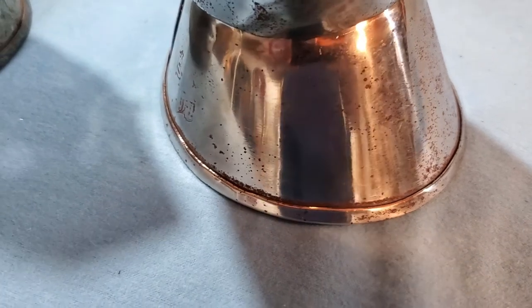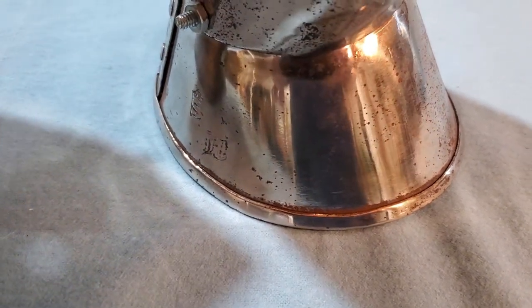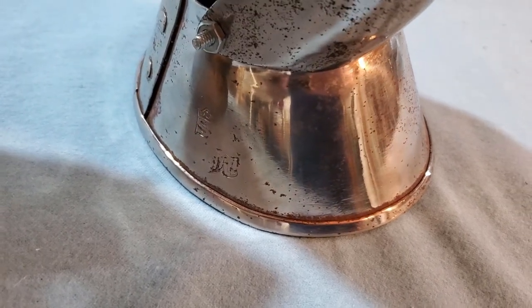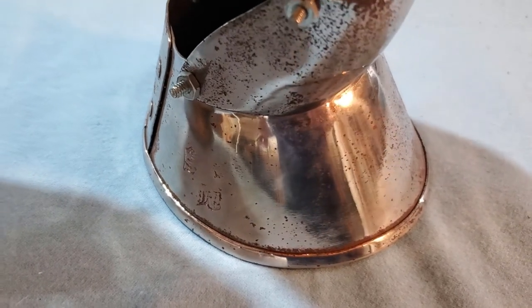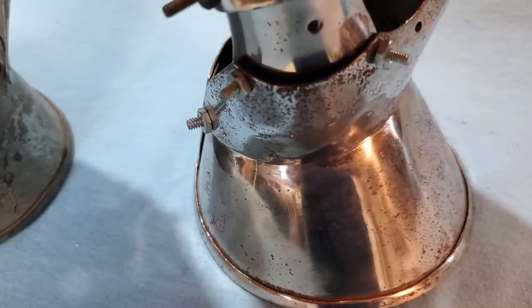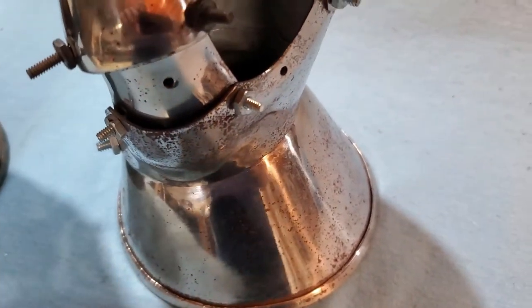The edge has been folded. Again, this was done because my rolls weren't very good-looking at the time, and the fold is an easier method to get a cleaner-looking finished product, so I chose to go that way while reinforcing the edge for when it's getting hit. So that was done.